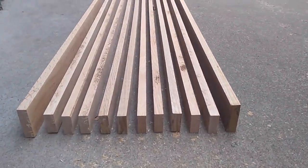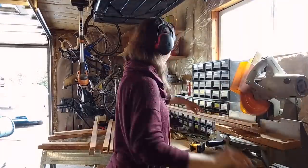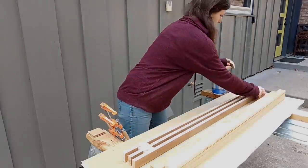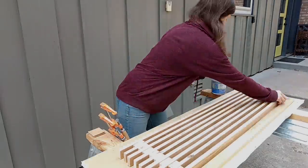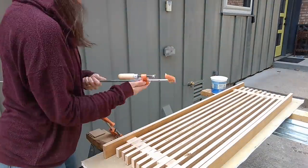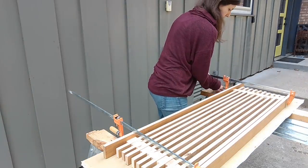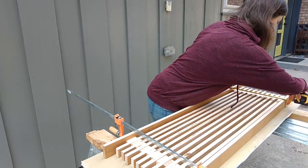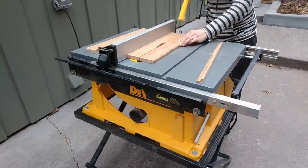You can kind of see the layout here in this clip. It was time to cut each of the slats to length, and using a miter saw, Christy cut each of them to about 46 inches long. The bench she's creating is going to have a picture frame of slats around it, so its final measurements are going to be 14 and an eighth inches deep and 47 and a quarter inches long. She had these specific measurements because it's going in a very special spot in her entryway to disguise a heat register along the floor and give some extra seating for people as they enter her home.